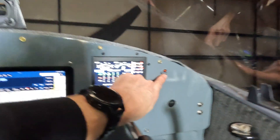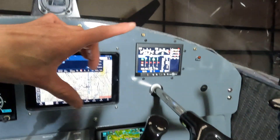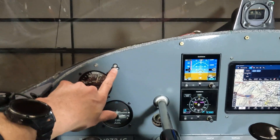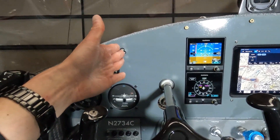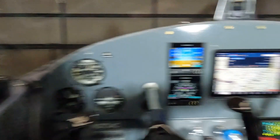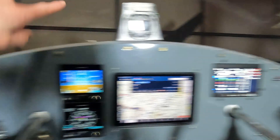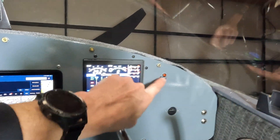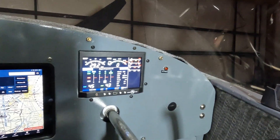I also added the alternator light. It was optional per the STC but I went ahead and threw it in, and I moved my engine light over here. This JPI has all kinds of settings set up for my engine and aircraft, and if anything exceeds the limit it comes over here and flashes — yellow for caution, red for warning, kind of like a big plane. They say to put this as close in front of the pilot as possible, so I moved it over that way. If I'm not paying attention to my engine monitor, I'll see red and look over. Now the alternator — it should trigger a low voltage in the JPI, but straight off the alternator there's your light. If your switch is on and you're not producing voltage, you've got an alternator light, just like most planes.